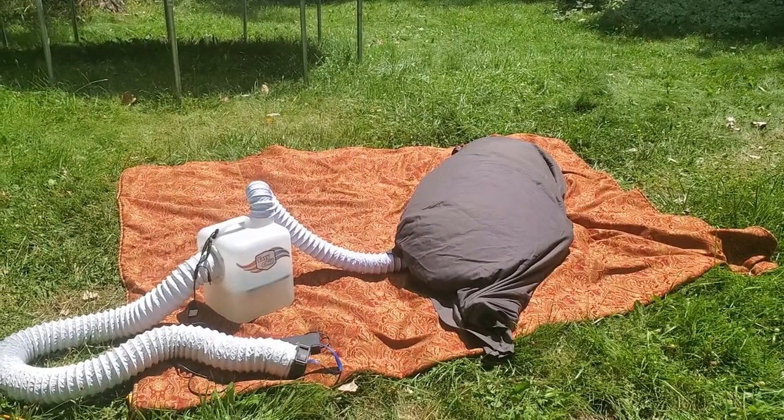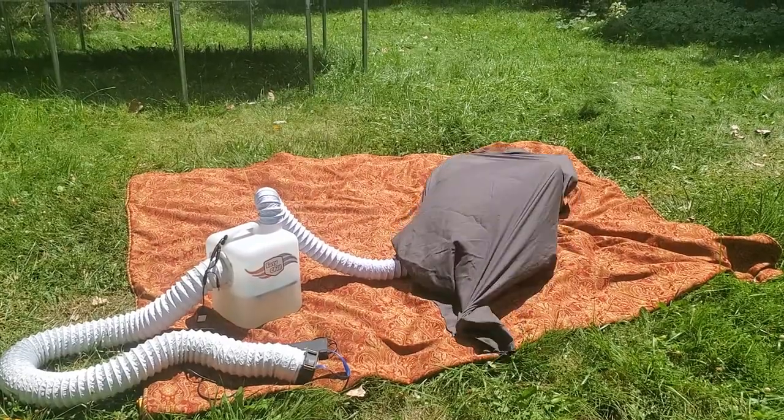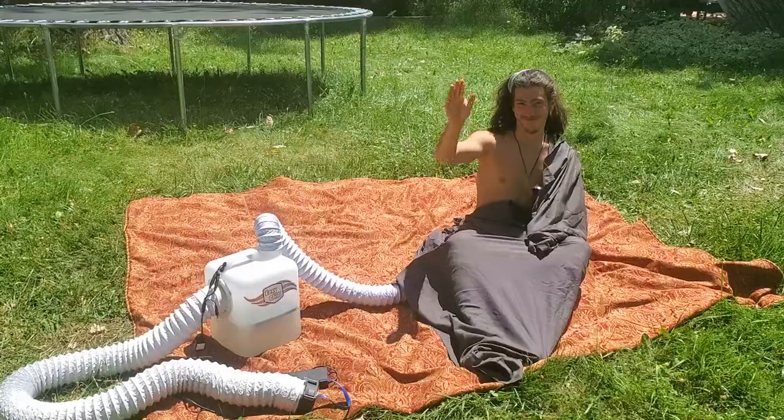It's not going to keep a tent or a yurt as cold as an air conditioner, but it's only using 2% of the power. All you've got to do is take this output tube and put it next to you, lay it next to you, and then put a sheet over you — it will inflate a bubble around you. If it's 10% relative humidity and 100 degrees out, you're going to be sleeping in a 68 degree Fahrenheit bubble. You're going to sleep so well.